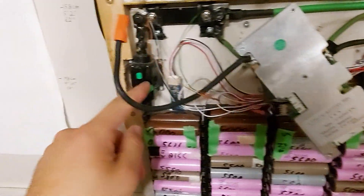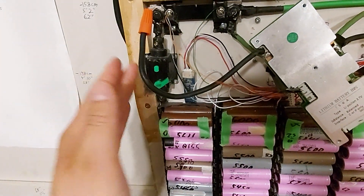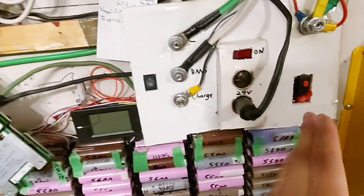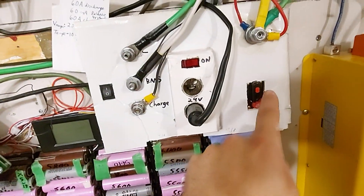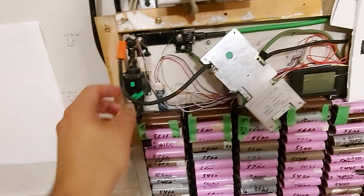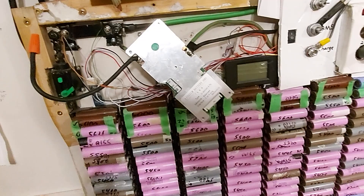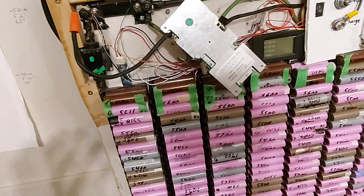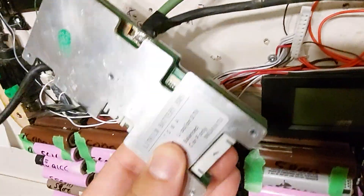You have to put one on the negative too. Because of the way electrons flow, you have to put one on the negative, otherwise you could blow the whole circuitry or fry something before the breaker trips. That's why all of these circuits seem to be designed backwards. If you don't understand this stuff, just put breakers on both — it's not that much money. Basically, catastrophic failure.